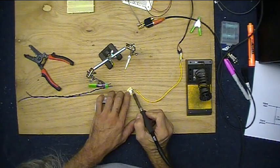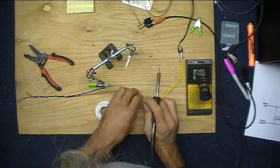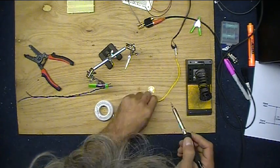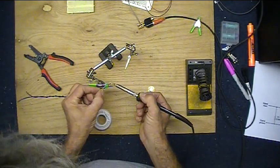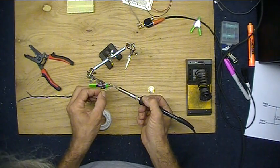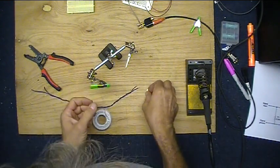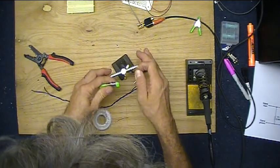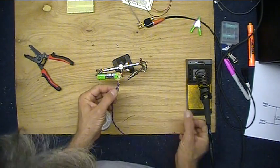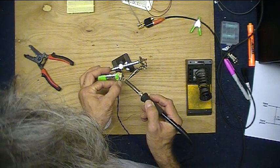Right then, first thing is let's get the wires off from the pickup that I soldered on for my breadboard prototype. And we'll tin up some leads that will go inside the guitar. Okay. Put our little pickup in the third hand tool. Handy little device. Solder on the negative.